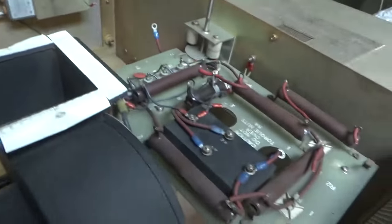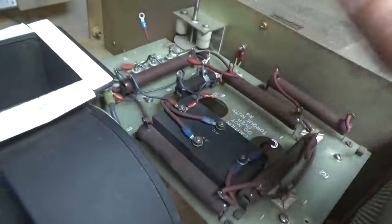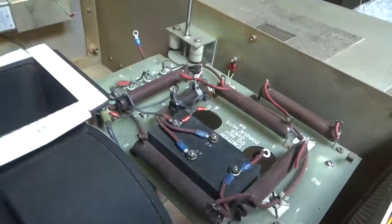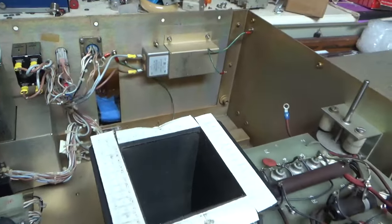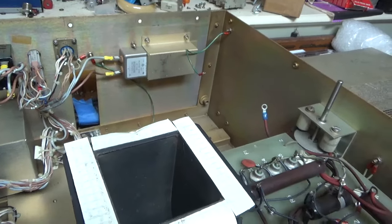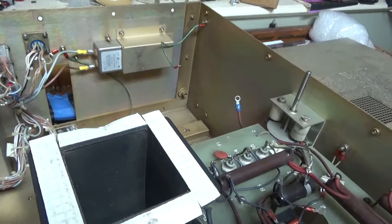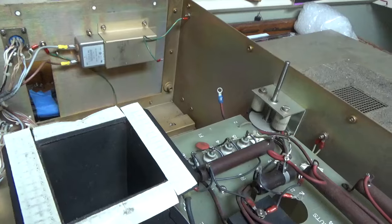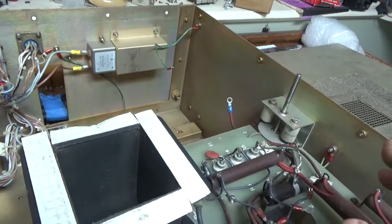So I'm going to be putting those electrolytic caps in here. I'm getting them from Jim. I'm going to have a lot of capacitance. I want good regulation. The plate transformers will be housed outside of it. They are 1.5 amps each at 5300 AC. So 5300 AC, that's AC, before it's rectified through a full wave bridge. So 5300 AC at 3 amp CCS.